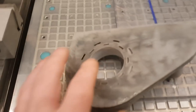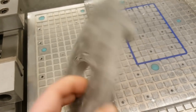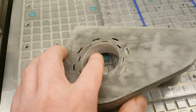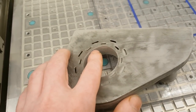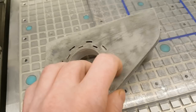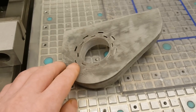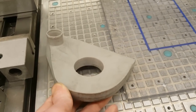Here you can see my old prototype nozzle which I learned from. It was a really quick and dirty design just to see if the idea works. It kind of worked, but it was generating too much foam because of those printed imperfections. When the printer prints, it puts one layer after the other and they are not always matching — you can scrape it and see it's a very rough surface. That was causing the coolant to pick up air because of those steps. The stream was also really broken up, and I thought I could do better.